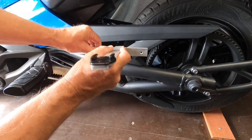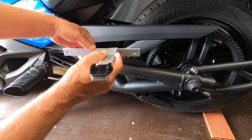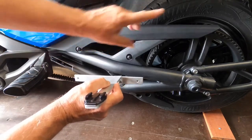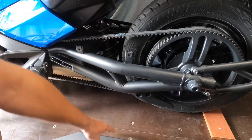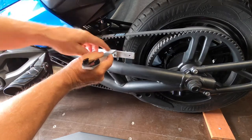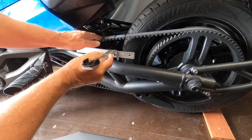Basically it's a bit of 25x6 aluminium — or for our friends in the US, inch by quarter aluminium. The belt guard, which I've already undone, the bracket will mount here onto this lug and this lug here, and I've got it angled. I've put about three degrees on it so hopefully we're going to look at the belt at roughly the centre point.